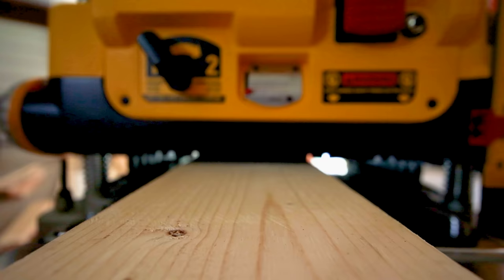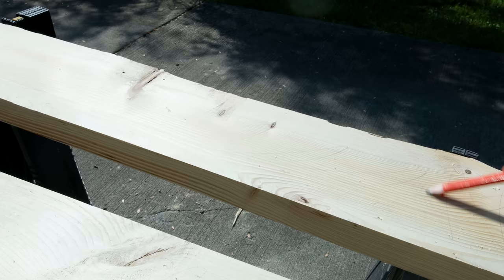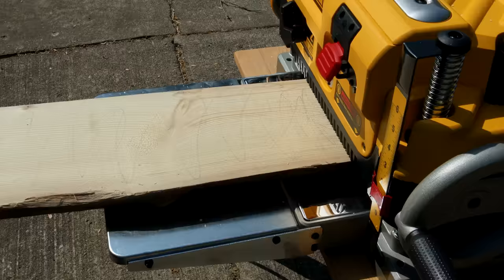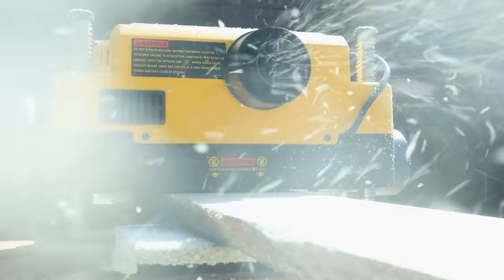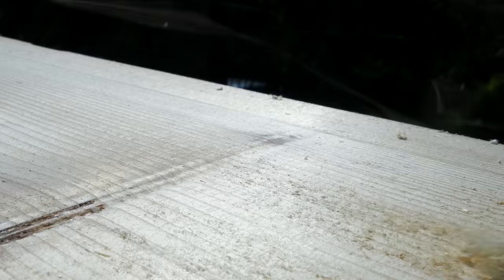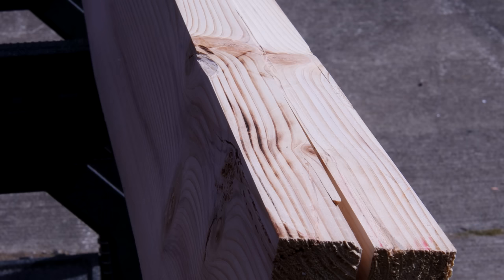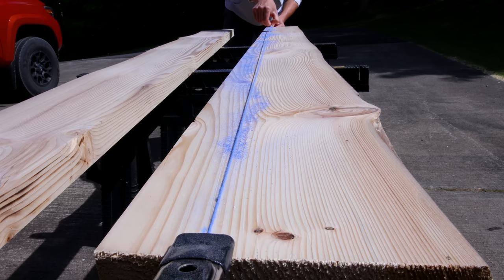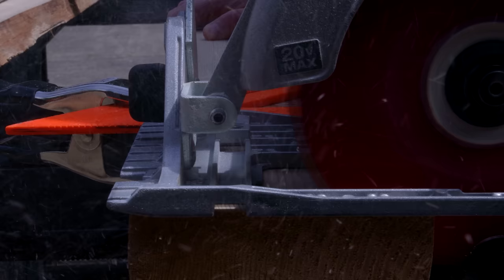I can fix that later though. I checked the thickness of the board to get a baseline and also marked them up to ensure I was removing any unevenness. After setting the depth, I began processing the boards. I find this so satisfying — these rough boards look so fresh and uniform when they emerge from the other side of the planer. The newly acquired flat surfaces allowed me to fix my cut from before. I measured for the desired size, ran a chalk line for a visual, ripped the boards accordingly, and lightly sanded the inconsistencies.